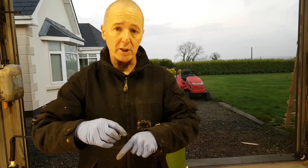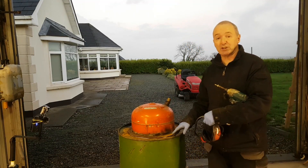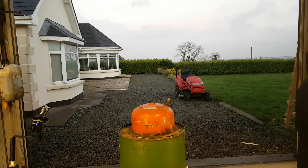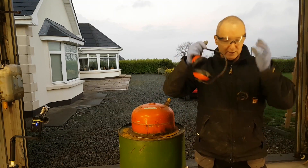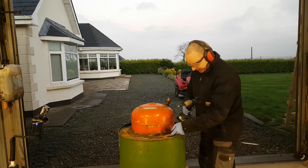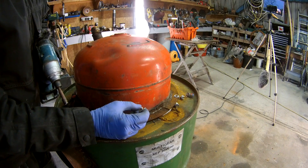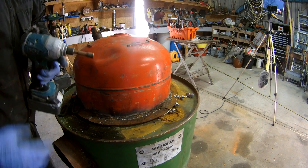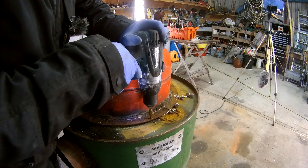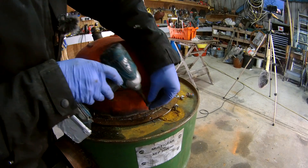I'm going to connect the propane bottle and the oil drum together with some tek screws. I'm going to drill them every four inches or thereabouts all the way around. Some ear protection and safety goggles. This cylinder got me before, so respect. If I try tightening through this top hole, what happens is it parallel-threads and tries to keep the same spacing — but I don't want that. What I want is for it to go through the top one no problem and pull in through the bottom one. I'm going to drill that one size bigger so it'll drill into the bottom one and pull itself down.